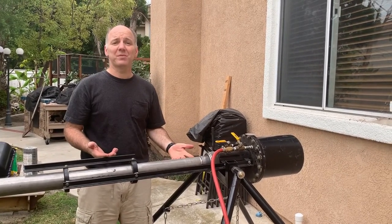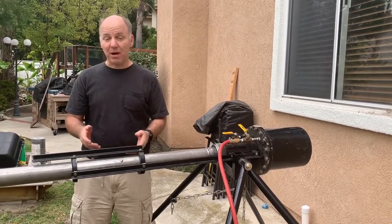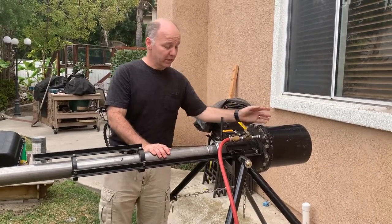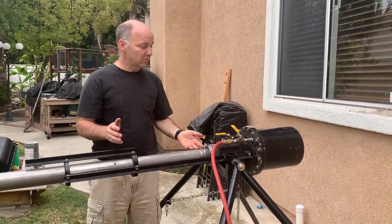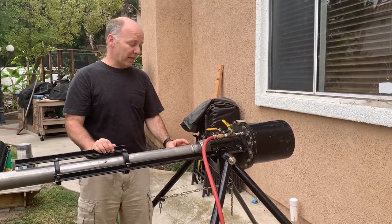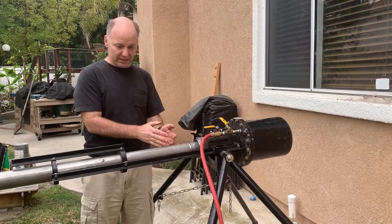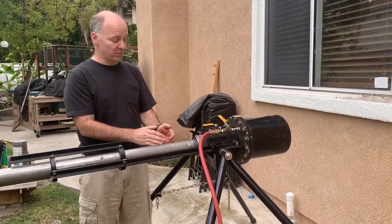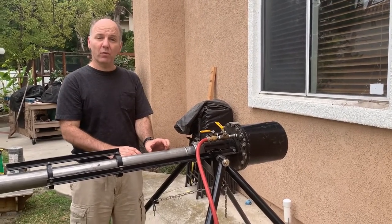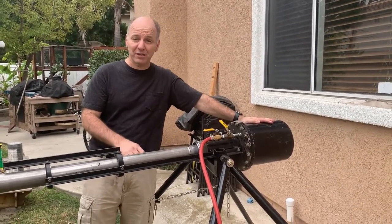The design is intended to get as much power into that projectile as possible, given the amount of air and pressure we have stored. If you look at a normal air cannon, the problem is that you have a valve that opens at a certain rate. As the valve is sort of slowly opening, in comparison to how fast the air is going to move, the projectile can actually start moving down the barrel before the full pressure in your tank pushes against it.